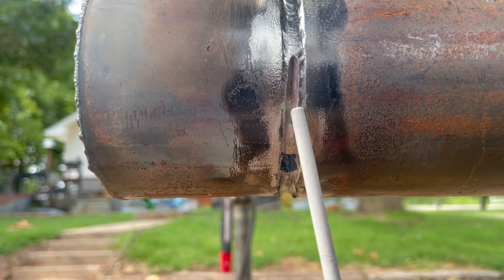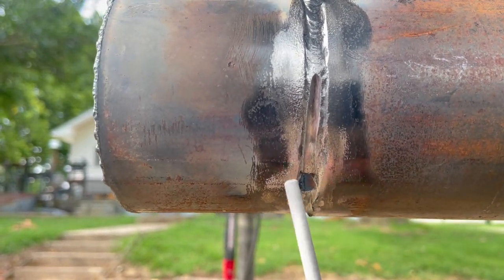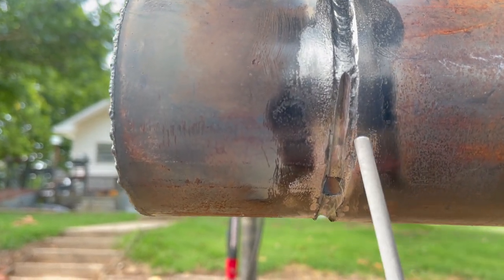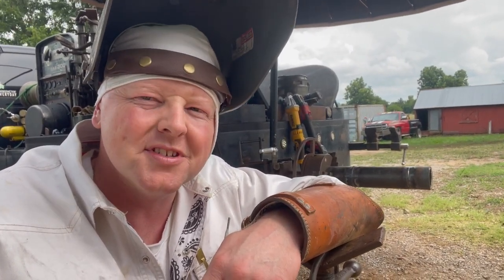Keep in mind this may take a couple of times. After your first pass, if it doesn't seal off all the way, let it cool off, grind it, and run back through it. You might push through a third or fourth time, but let it cool off between each pass. That is probably the biggest thing that'll help with burning through — and this is even more important on test day: staying calm, being patient, and letting your material cool off. That is probably the number one tip I learned over my years of pipelining.